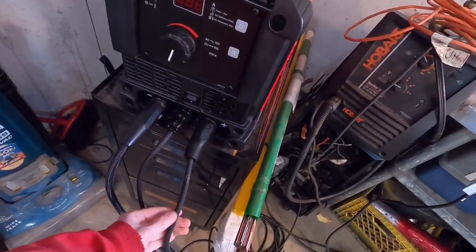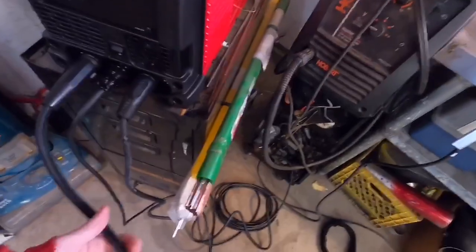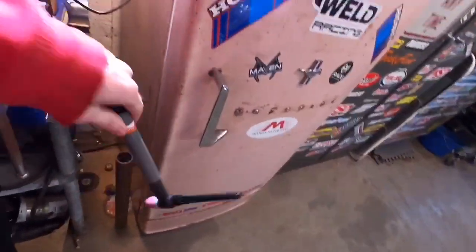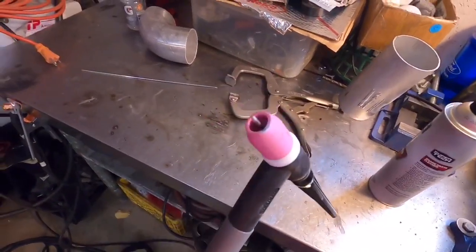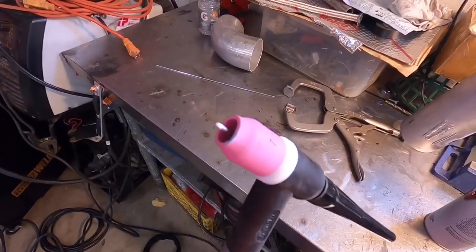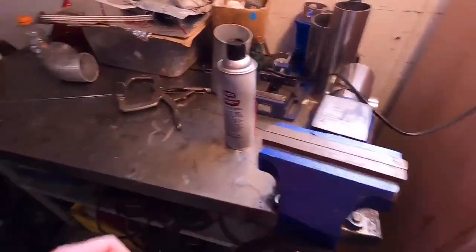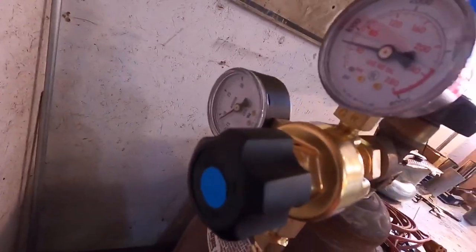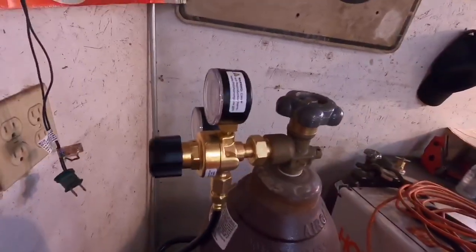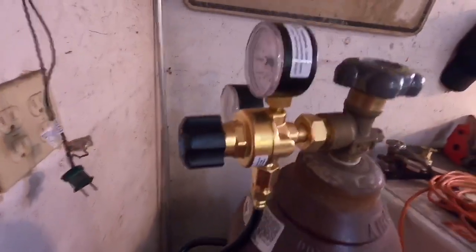You can really feel it in the leads — they don't feel hard and plasticky, they're actually rubber with good copper inside. The leads are a million times better. The flex torch on this is a lot nicer too; the other one was just hard junk plastic, this one's a lot beefier. I went ahead and put a gas lens on here because I hate the standard collet-style ends that come on it. This is a flex head torch. As for things I don't like so far: it comes with this little regulator — it's not horrible, but the AHP actually comes with a flow gauge with a little ball that moves up and down so you can really dial it in. This one will work fine for now.